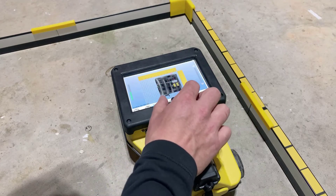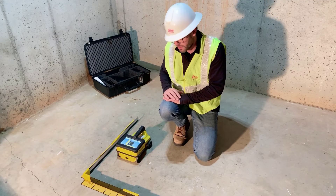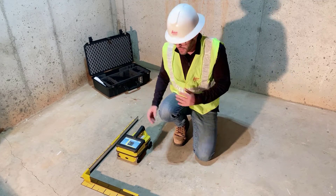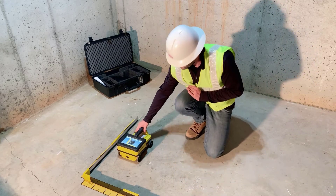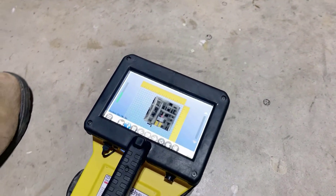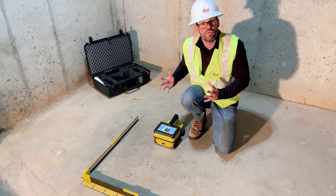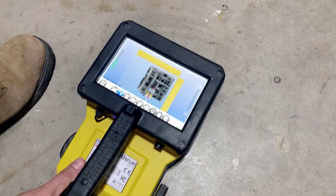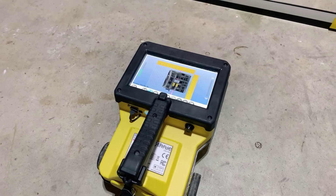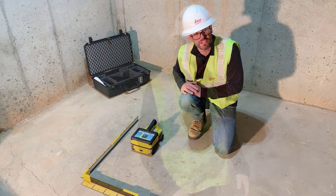Now we can see the multi-layered view — looking at the whole slab in one hit, without needing to go through at different levels. If I want to mark a place to drill safely, I simply drag the See-Through to a point where there are no rebars or anything showing on screen and mark the front of the See-Through as the location. If I want to mark a rebar, I move it forward until I see one of those grey lines and mark it. We are being totally tracked by the trackpad system built into the unit.